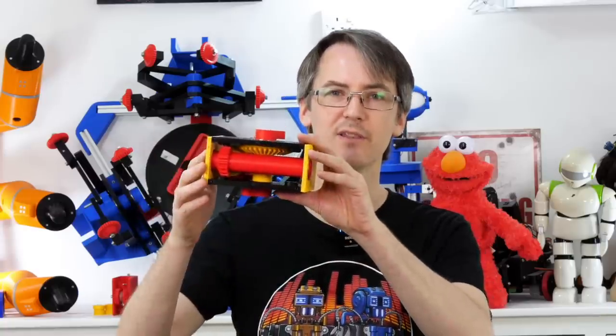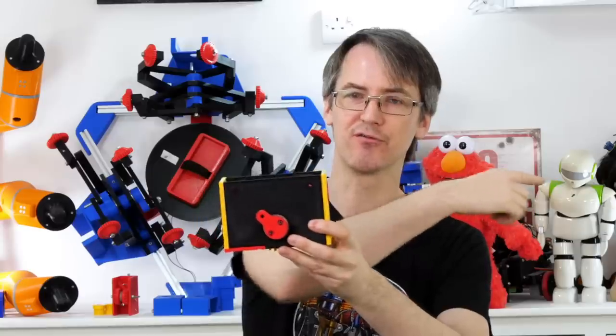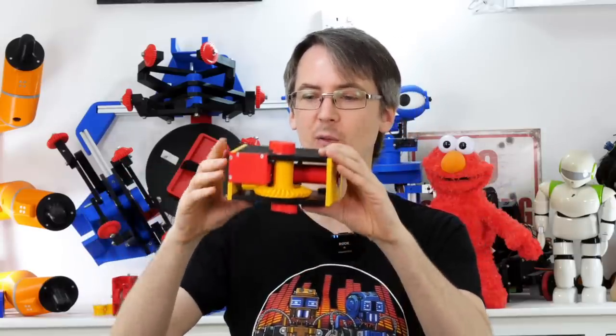The reason we've done it this way — with this overhead shaft that turns the spur gear, turning the bevel gear, and finally turning the motion for the legs — is so that we can keep the motion going in the same direction through all of the segments. If we went in at one side of the bevel gear and out the other side, each alternate section would get reversed and that means some of the legs would walk backwards.